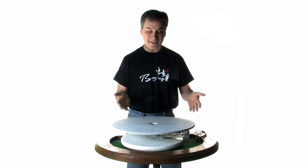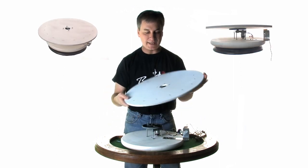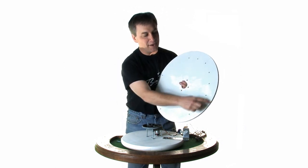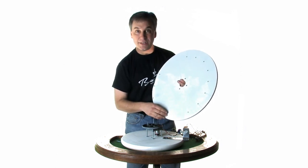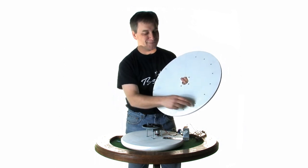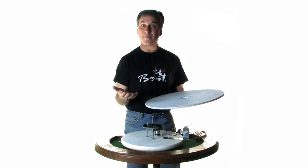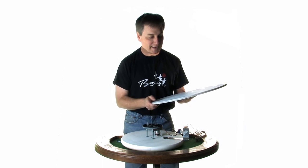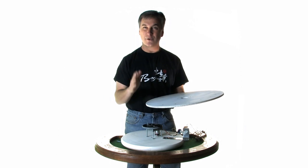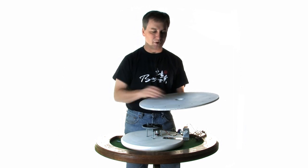The method for doing it is actually fairly simple. For our zoetrope, we need a spinning platform. I simply cut a piece of particle board out in a circle, and around the circle I measured exactly 16 perfectly even spaces, each to feature whatever object we'd like to animate. You can have any number of spaces — it depends on what frame rate you want. In this case 16 fit well, and I can slow the animation down to about 15 frames per second and still have a smooth, attractive animation.